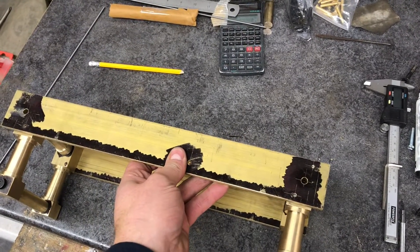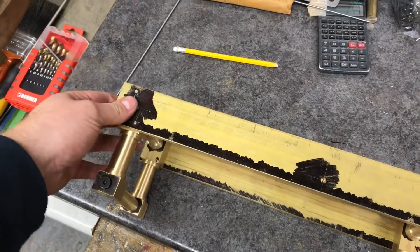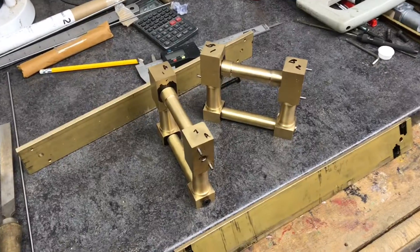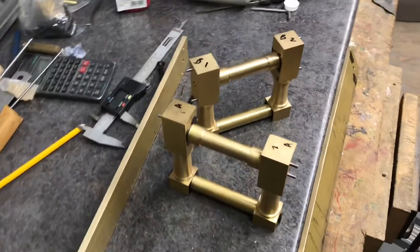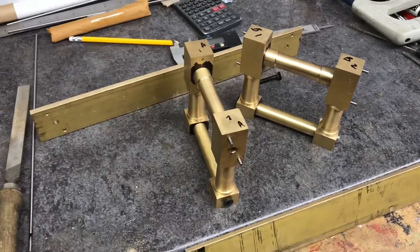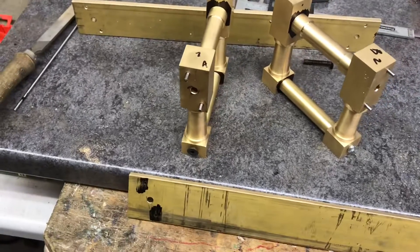It's a really nice fit. It's a bit difficult to do with one hand, but there you go — it fits on quite nicely. That's the frames all pinned on both sides, really nice snug fit. I did have to use a broach just to ease the holes — I used a reamer and a drill to cut the holes originally.